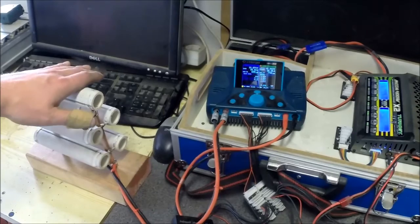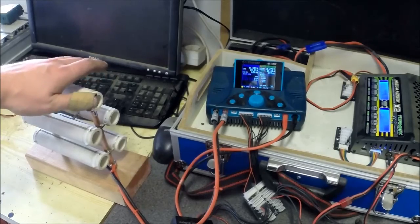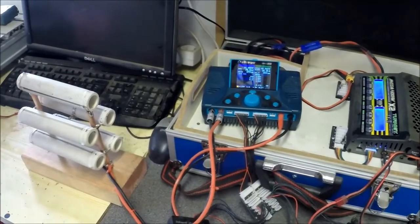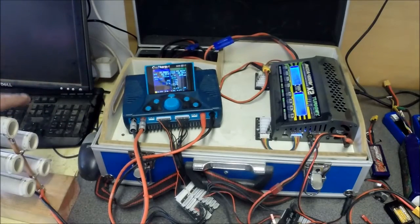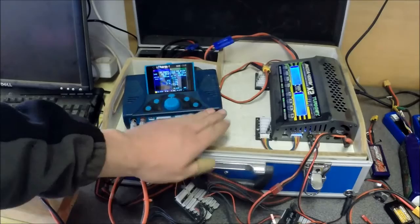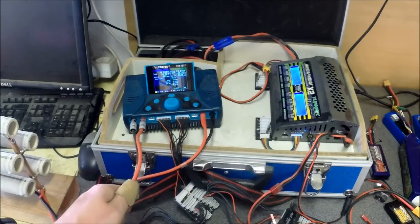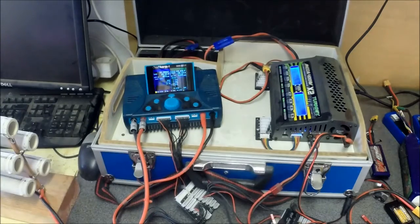It's warm - in the sense that I cannot really hold it. I am guessing 50 degrees or something like that. I am not sure if it's going to get much hotter. It's up to 60 degrees, something like that, but I am pressing it hard - as much as this charger can. I would say that I do need to have a fan on this later on, but for now this is good. It will work. The cables have no heat in them - that cable there is a little bit warm but it is a little bit thin. This one is nothing at all because it is a much more dense cable. So I would say this is pretty good - it works.